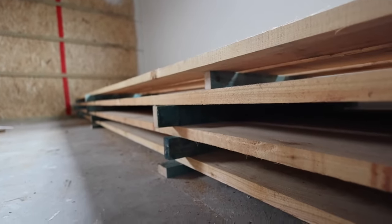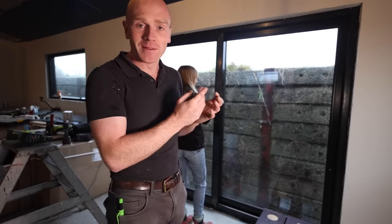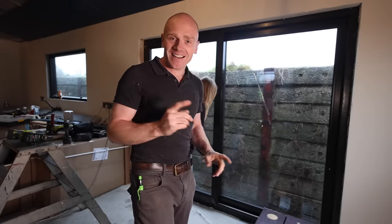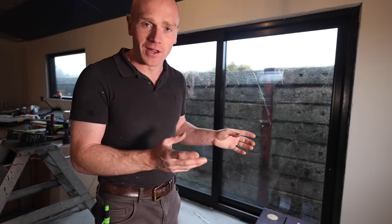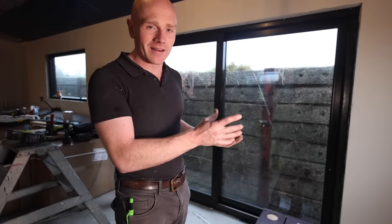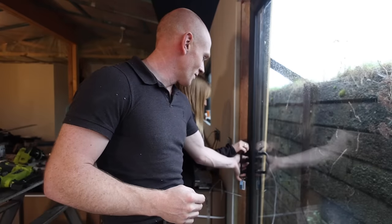I didn't film a few bits when it came to fitting the patio doors and I don't know why - I either didn't press record or I was just having a nightmare with dad. Not because it was my dad, but because we were trying to adjust the rollers and everything to make it fit nicely. What we didn't realise is it's far easier to do that once the glass is in - once the glass is in, things work a bit better. There's more weight behind it.